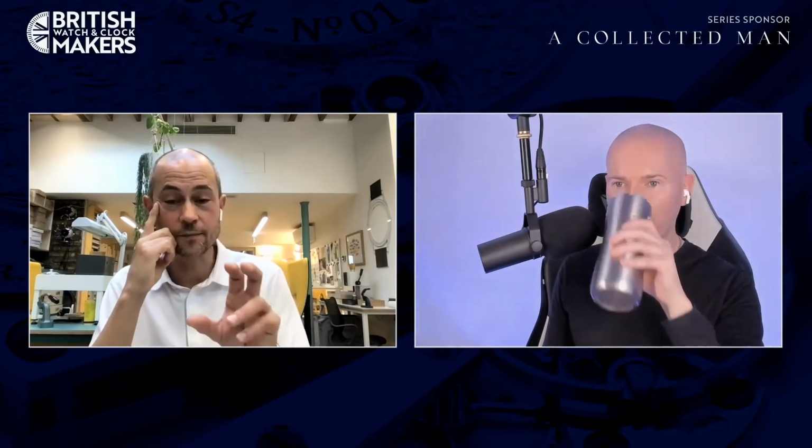He was fascinated that we'd only ever done watches with two precious metal gildings on. So he decided he wanted us to do one with three on, which is why there are three robots on there. Technically, it was actually a big challenge because it looks fairly simple, two gildings versus three gildings. I mean, how hard can it be? The problem with the gildings, once you start layering them up, is that subsequent gilding layers start to peel off the previous ones.